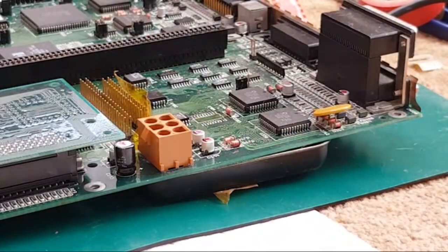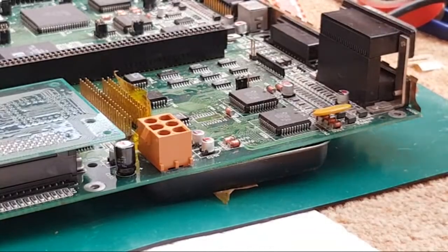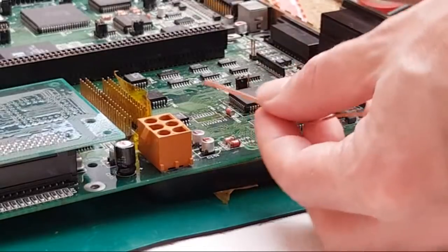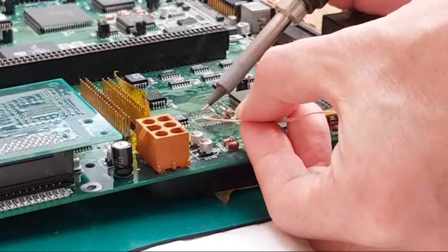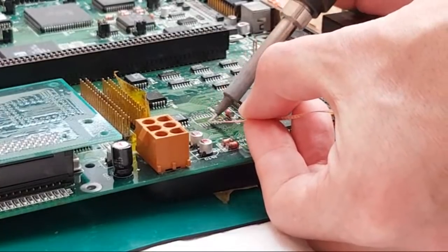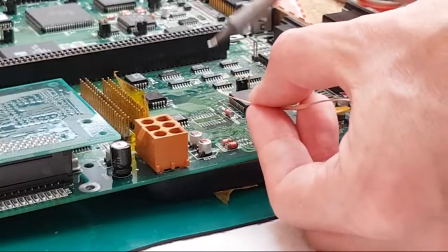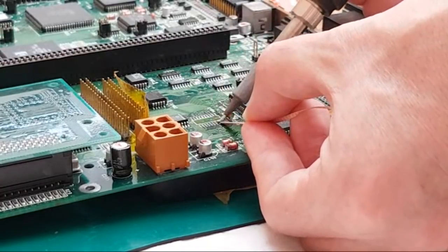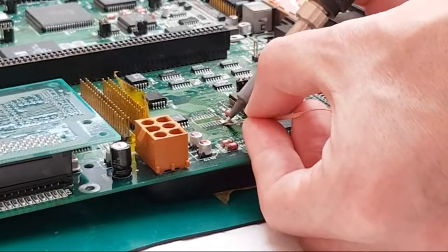I'm guessing what happened was, I maybe shorted one pin to something there, and it interpreted a read as a write or something like that, because the compact flash just got corrupted. I didn't have a backup of that exact compact flash image either, which is why we've gone to that sort of classic, the one you've just seen. It's like classic Workbench, isn't it, with a blue background. It's not got the background image and all that sort of stuff. It's different.